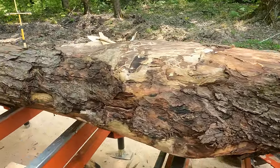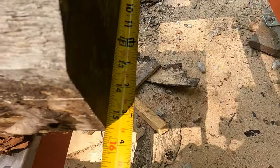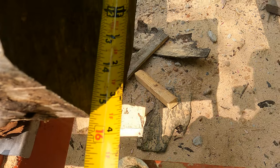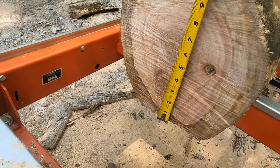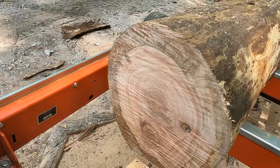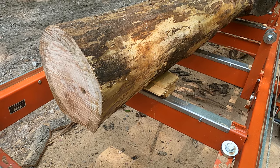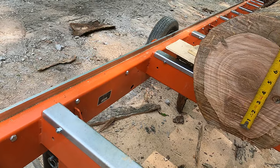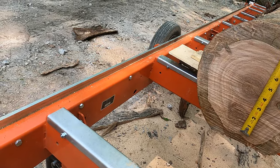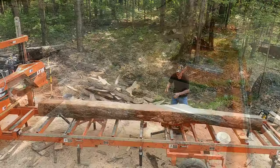Today on the mill, we have another 15-foot log. And yes, I'm gonna try and get a 4x8 out of that, which should just fit. But the log's not real straight. I don't know if you can see that, but it curves. So we're gonna try. This is, I think, another maple. So this end is about 15 inches. The other end's 11 by 11. So I think I need a 12 inch to get a 4x8. Where's 8 inches here? Right there. Yeah, I might be able to do it. We'll see.